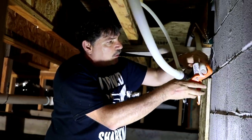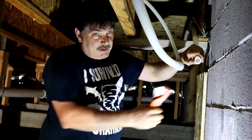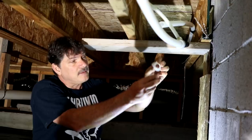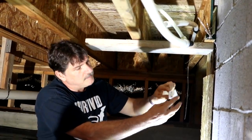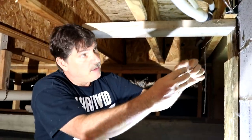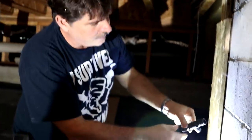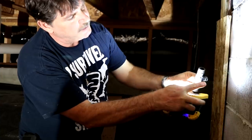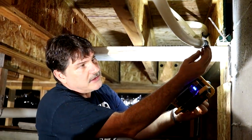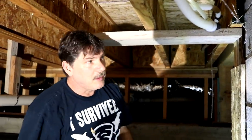That guy didn't go on all the way, really irritating. Luckily, we have a little slack to pull this. We got plenty of slack. First, I tried to split the PEX ring without getting into this too far, but I did. And what had happened is the little ridge on the fitting that's doing all the sealing, I nicked it. I can feel it. I'll run my fingernail around there, I can touch it. So I could put this all back together, it might not leak. What a pain if it does.